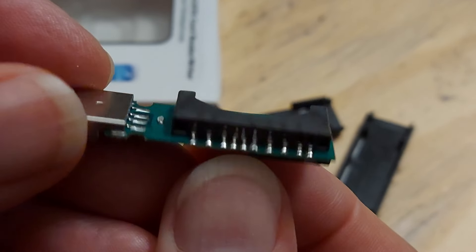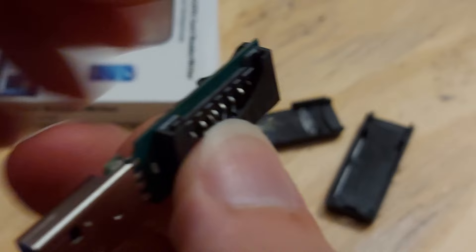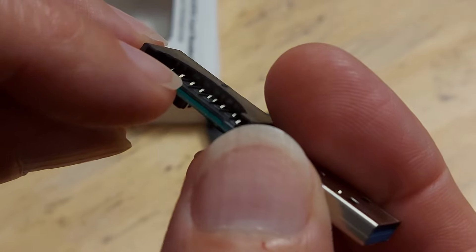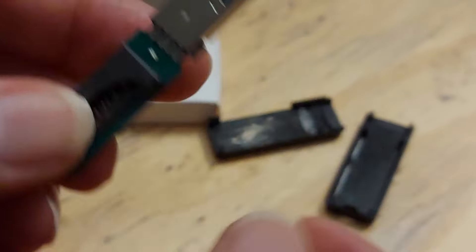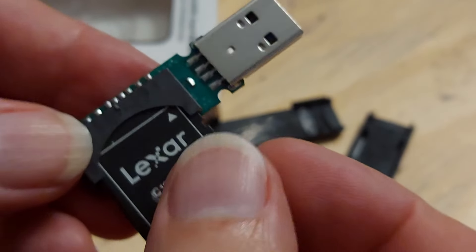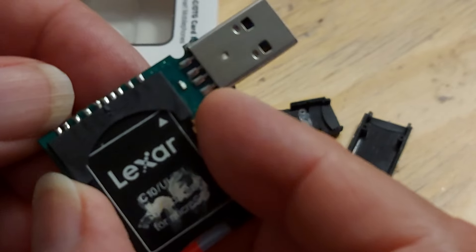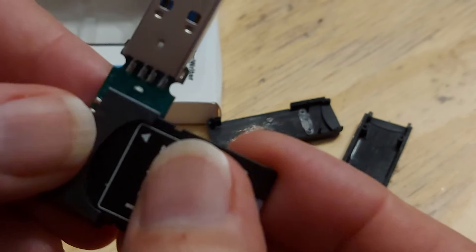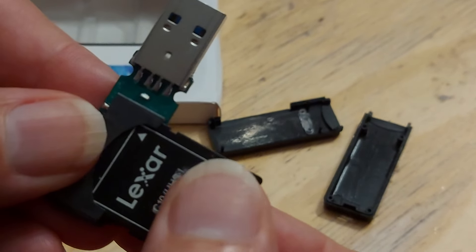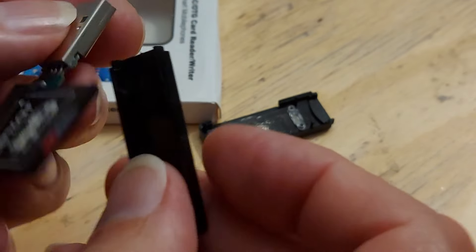Can we see this? I've reflowed the solder on those tags that looked a little bit suspect. I've also used a pin to go in there and try and push that finger up that seemed to be a little bit low. And I've tried it, and it seems to work now. So whether it was the finger that was loose or whether reflowing those tags has helped, I don't know which it was, but it seems to work. This does seem to be very loose in there. But having done that, it's certainly worked, so I'm going to put it back together and continue to use it.